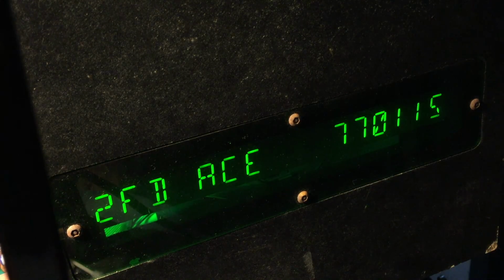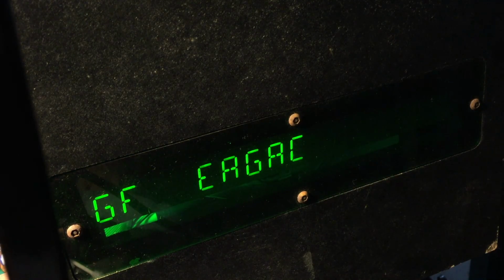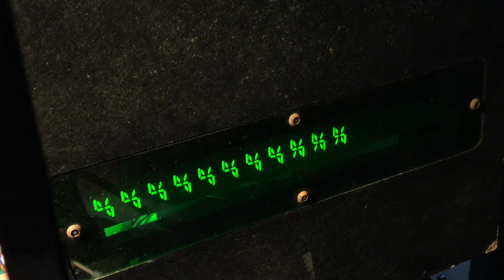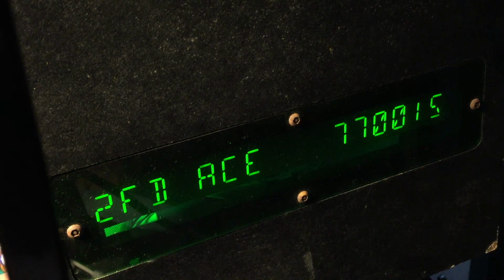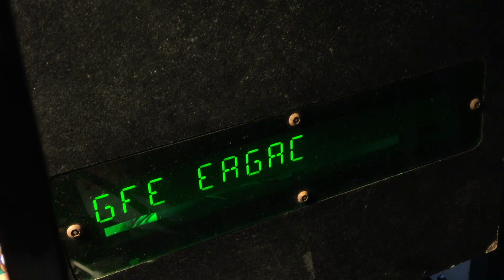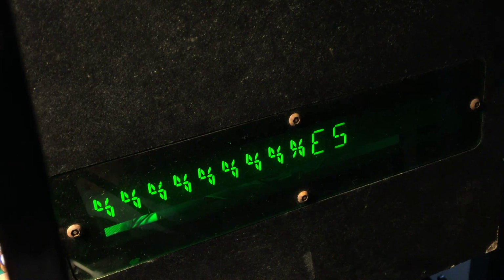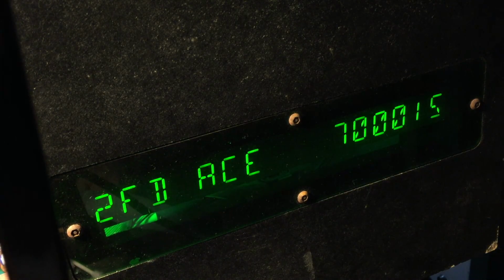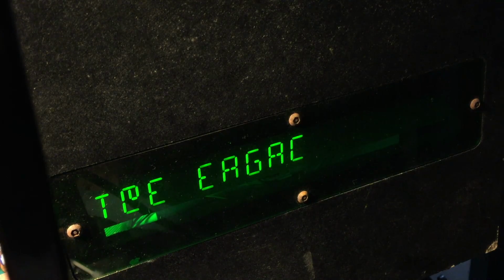Yes. So that was the problem with the player type. So that's one thing down. I'll have to try to either clean that dip switch somehow or just replace that switch bank, which I'd rather not do if I can avoid it, but we'll see. So now we have the question of why are we missing a bit on the scoreboard when the logic probe tells me that that bit is toggling.